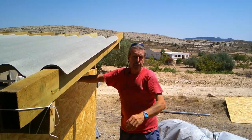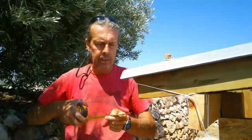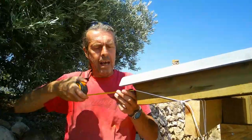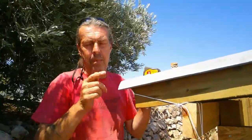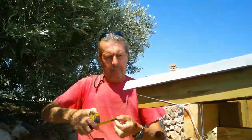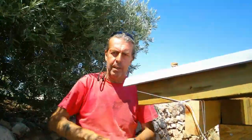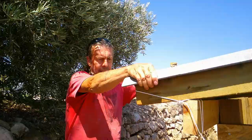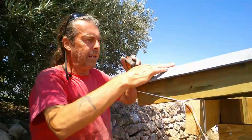Right, so let's get these roofs fixed on. The gutter's 120mm, which is about 5 inches. We're going to overhang that 60, so it should drop pretty much in the centre of the gutter. In fact, thinking about that, we want it just in a little bit, don't we? So we're going to make that 50, if that makes sense. Too far. They don't move easily, and then they go all at once. Another mil. Okay, that's got to be it. Perfect, 50mm.